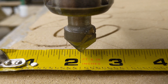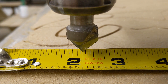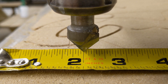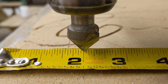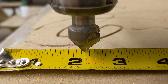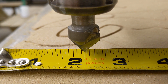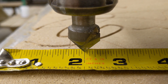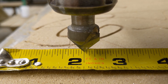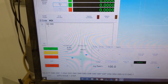I'm going to show you real quick how I do it and you'll see how accurate it can be. What I've done — as you can see — I've set that V-bit right on two inches, as close as I can get. We're going to take away all of the measuring error; whatever error we have will be divided along the full length of the bed. If my eye is off a couple of thousandths, divide that over eight feet. I've set the work origin right where you see it over the two-inch mark, and now I'm going to use the computer to command it to move all the way down to the other end of the table. At the MDI it's a simple command: G0 X90.